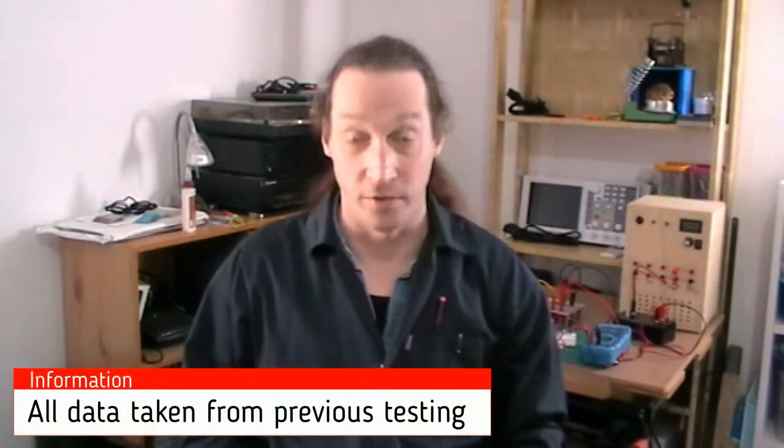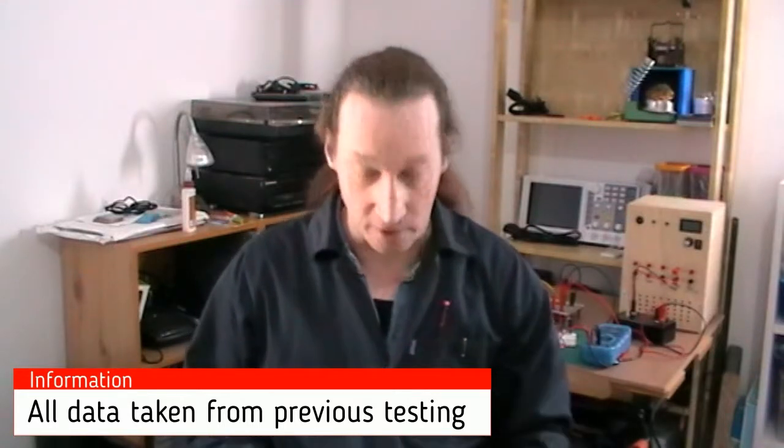Quite a simple device, very easy to set up and easy to understand really. Basically I managed to get out a lot more current than I put in. Like the first setup I put in 6 microamps, managed to get out 610 milliamps through the circuit. That's nearly a gain of 100,000. Each individual transistor, you'd never get that sort of gain, even though some transistors have 300, 400 on the beta for its gain, you wouldn't normally get 100,000 gain.